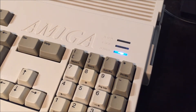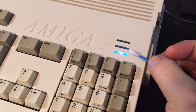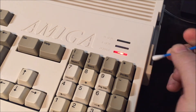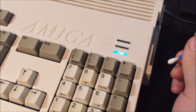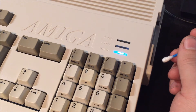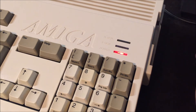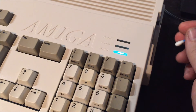Configuring the Bifrost board is very straightforward, simple, and non-intrusive. The LEDs look like normal LEDs but they contain a twist — the right side of each LED is also a button, and these three buttons help you navigate and configure your Bifrost board anytime without opening your computer. The computer just needs to be on, since the Bifrost board gets its power from the Amiga.